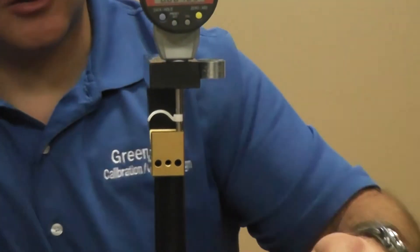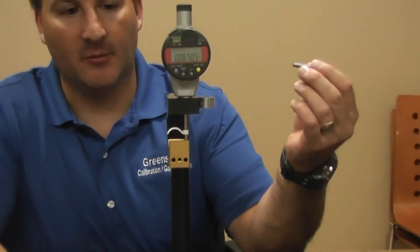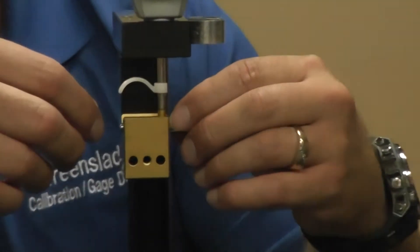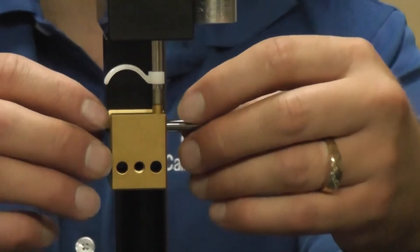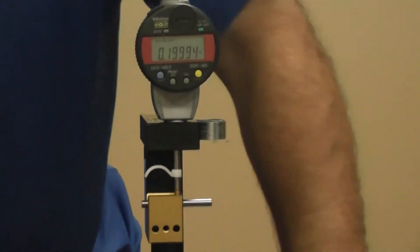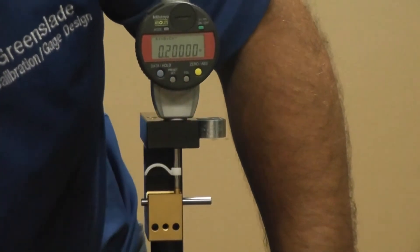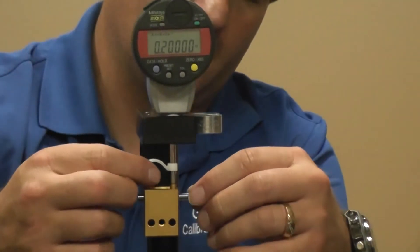How we're going to actually use this gauge is like many gauges — we have a master setting pin. This is a 200 thousandths class X master setting pin. What we do is lift up our indicator point, set our master pin into the slot, come in here and preset by hitting it twice, and now we are ready to measure parts.